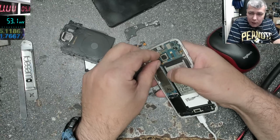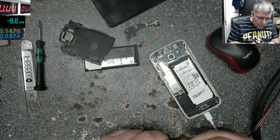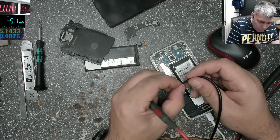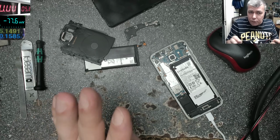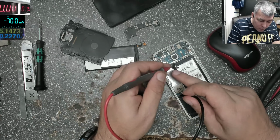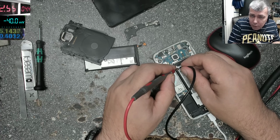But if you check the battery using a current limit, in our case 2.5 amps, because that's how much we use, we can use a different limit. Let's just make a difference between this battery. Leave that current. Look, I can go up with the voltage, 7.5 volts. Actually, if I come here with 7.5 volts, the voltage gets dropped because there's a current limit. So how many volts do we have right now? 4.4 volts.